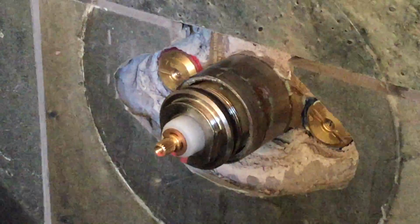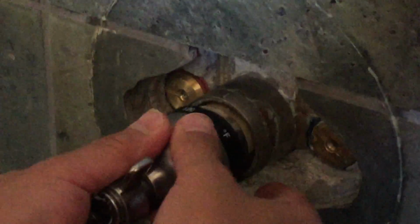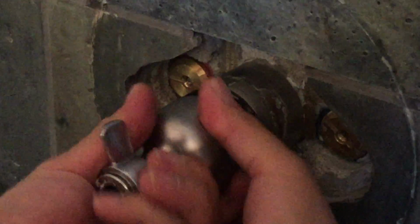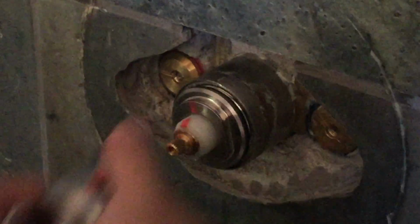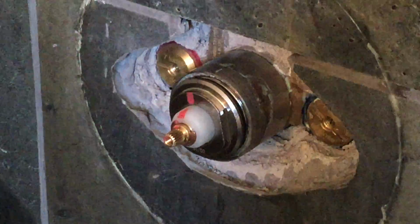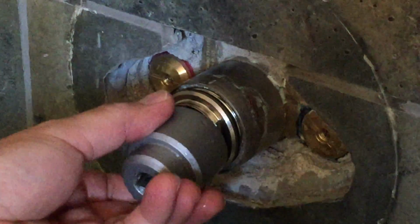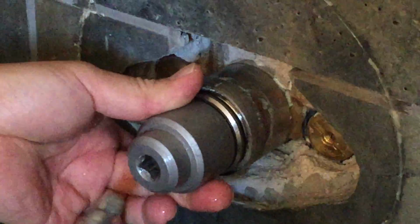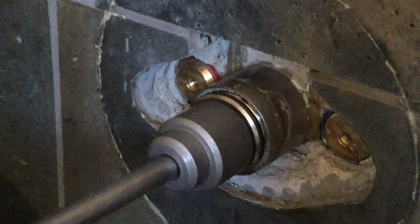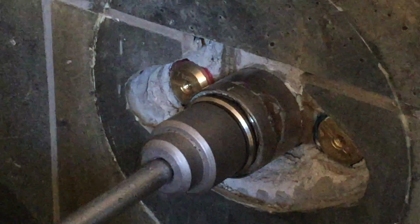Most critical in installing the cartridge is taking it to the 10 foot-pounds. The installer is using the trim to help grip the cartridge to engage the first threads. A little trick of the trade. But the critical thing is not the red line orientation at all. It is ensuring that it is torqued to 10 foot-pounds. The red line orientation is arbitrary.